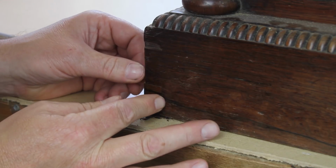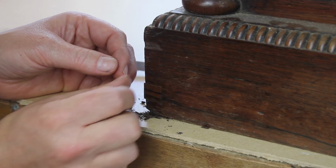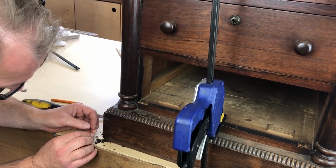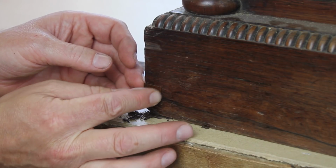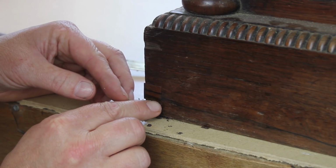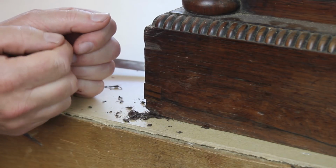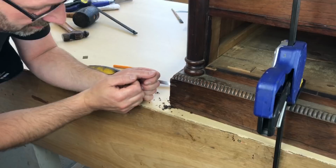Look at that. So this bit here where it's oversized off of the edge, I can trim that once it's in. So once the piece of veneer is glued in place, it's been left, I can just trim that edge down to it nice and smooth so it blends into that mitre edge there. But as you can see, there might be a tiny little bit of wax maybe needed just around the edge here, but by the time I grain and colour that through, that's gone, and that's using a period piece of rosewood from old furniture, so a correct repair.